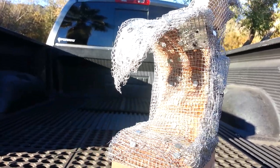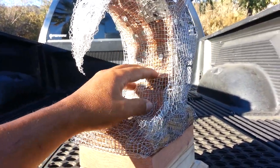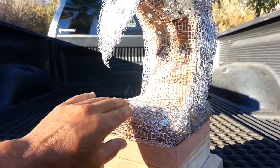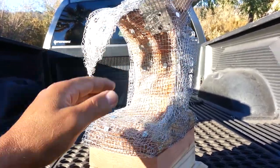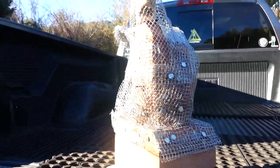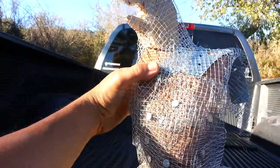It has galvanized tacks — roofing tacks — that hold the mesh in there, because the mesh is doubled up two or three times. This is a technique I learned in college so that when I apply the plaster, it goes in there and makes good contact — it has some depth to it, instead of just sitting right on top of the wire mesh, where it would have a tendency to break off.